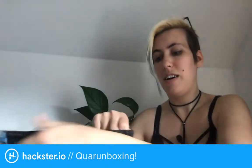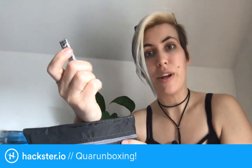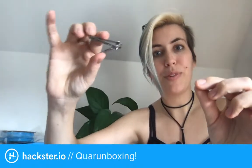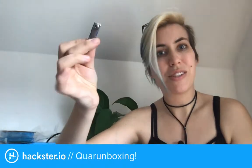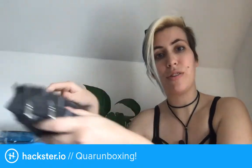So along with that, what I usually pack inside of here is a pair of nail clippers. One time when I was traveling, I realized that you can actually use these really nicely as wire strippers. Like, look, it's tough. You can clip through the whole wire if you want, or you can just very precisely grab the tip of the wire and pull the plastic sheathing off. So convenient. So I recommend having one of these. Plus, TSA lets you keep them, and it's less suspicious somehow, and it's also lighter than a pair of actual wire strippers. So that's my sort of on-the-go soldering kit.